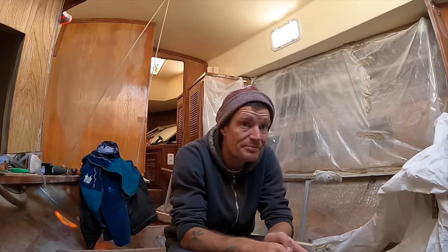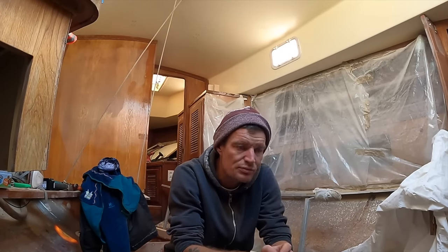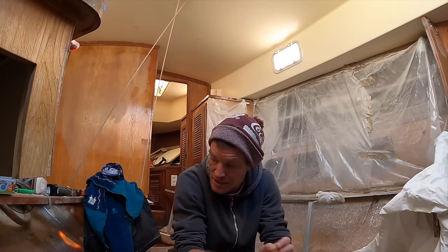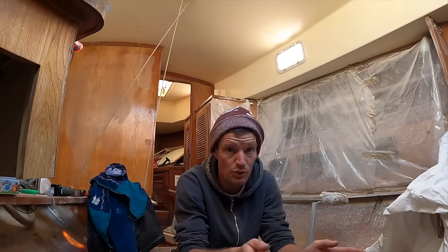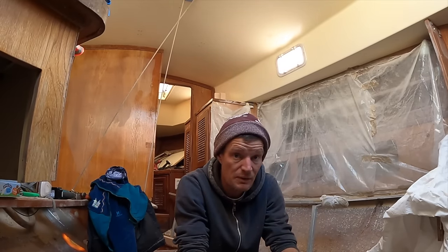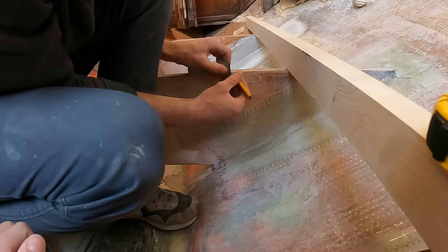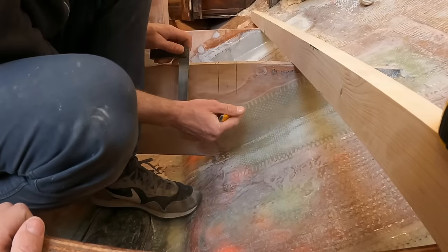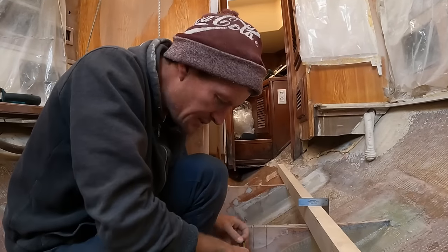We'll maybe have to get in the engine room and remove those shelves. It needs to be done - probably not next week but the week after. I want to do the flooring first - put a bit of flooring in, even if we just cut the floor and lay it in. We can tab it, lift the floor up, paint under the bilge - it will make life working on the boat massively better. Stu is marking where he needs to cut so we can get tired of prancing around like a ballerina.